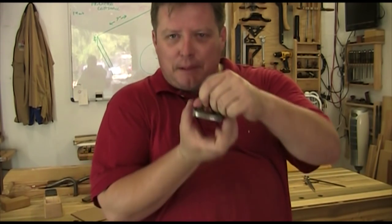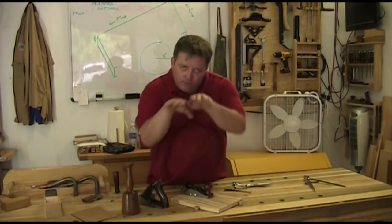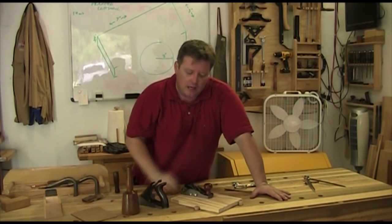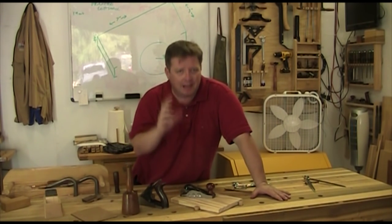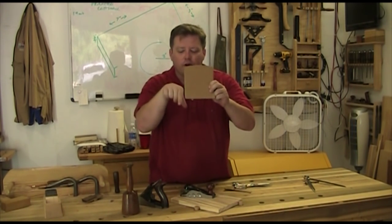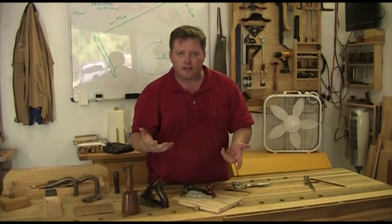Plane tracks on the sides — the plane blade will tuck up inside the plane so you have a smooth feathering to the edge. With a minuscule curve, it's not something you can feel running your finger across it. Plus, having that curve where it feathers to the end tends to eliminate a little bit of tear-out. It's not as aggressive — you're just not ripping the fibers out, it's kind of feathering to the edge, which works a lot easier for figured wood. I like it because you can plane a tabletop and the edges are feathered so you don't have plane tracks. If you had a straight-across plane blade, even though it's only coming out a thousandths of an inch, you're going to have a sharp edge on each side that you can feel with your finger — a ledge you'll need to sand out.